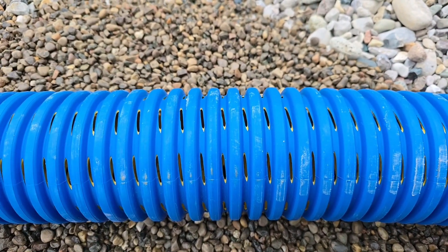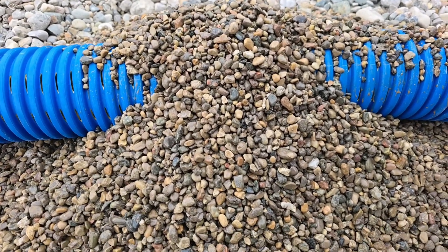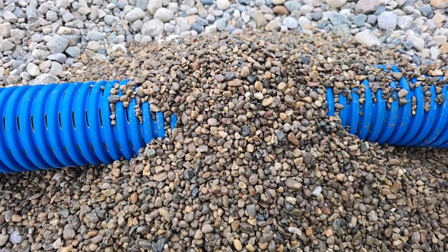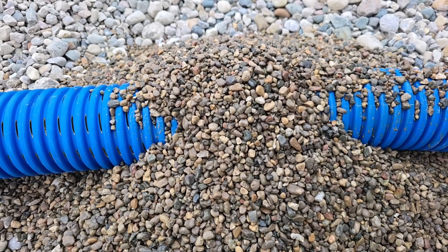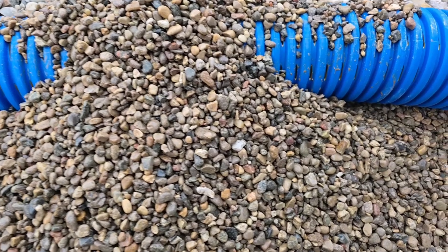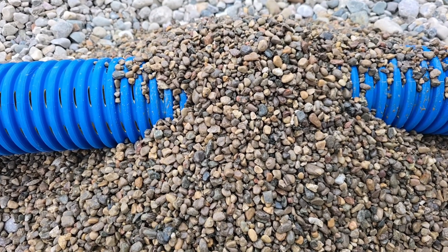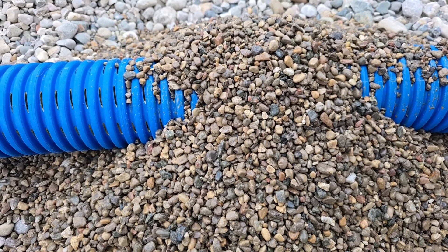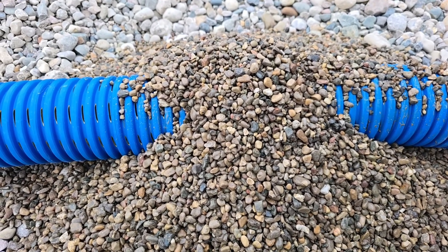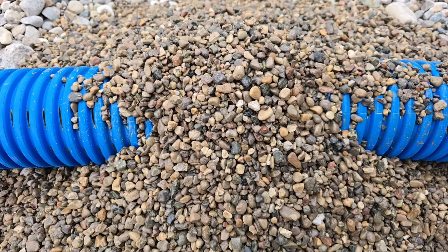You have to put all pea stone, which you can buy in dump truck loads or train loads — and on certain jobs we'll order it by the train. You want to surround the pipe with a good stone filter zone because you're not using fabric. You want at least four inches under the pipe; I really prefer eight inches on top of the pipe, because you're going to throw dirt right on top of the pea stone without any soil separator. I still like a wide trench — the more stone, the better the French drain. I'm always going to tell you it needs to be 14 inches wide, but this is how you build a French drain system that lasts a long, long time.